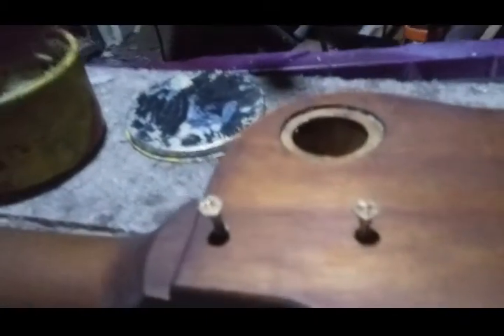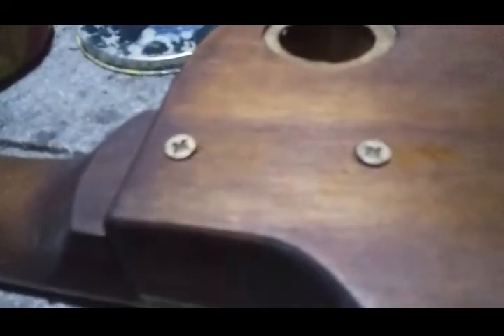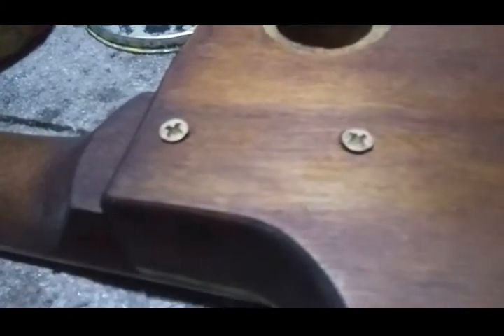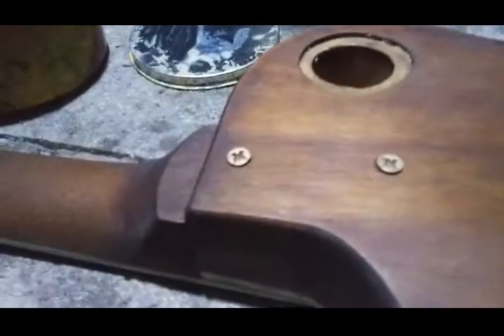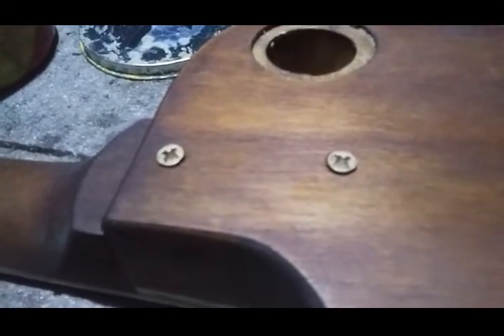Okay, got the wax, peeled the tape off, screws are waxed up, got the screwdriver. Got them started by hand and now it's just a little quality time with the screwdriver. Since they're painted I need to be very gentle so I don't chip the paint. I need a slightly larger, better-condition Phillips to finish torquing them down flush. I could also go a little deeper on the pilot hole or add a small chamfer by hand with a drill bit to help the screws seat flush.